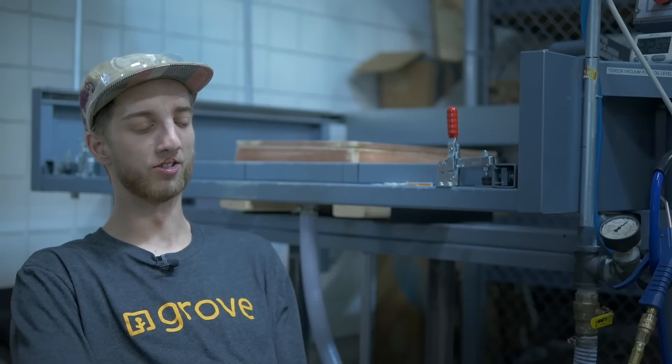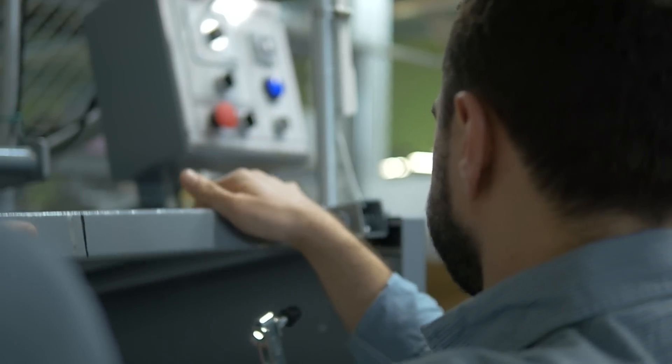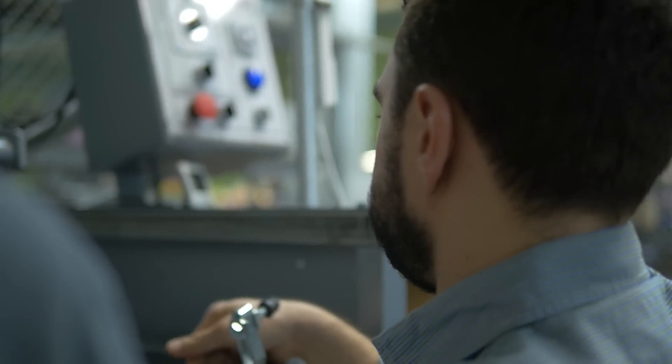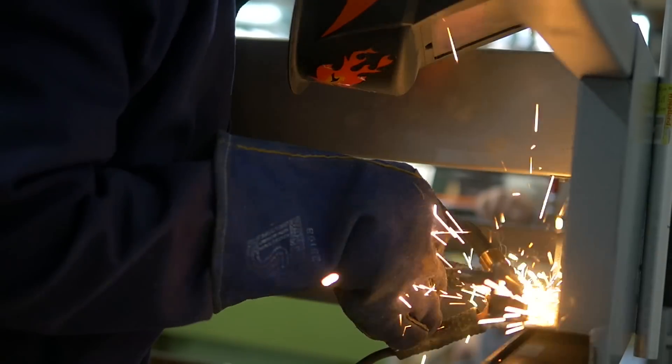After using Chomper for a little while we ran into some issues — some poorly done welds and some other issues with misalignment and racking. So what we had to do is take the hinges off, grind them down, set them in place again, tack them in, and weld them.